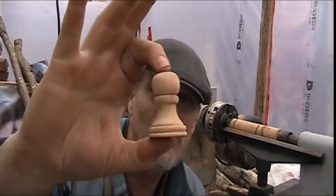I came up with a wee little one — that's about normal size, a little squat fat little guy, my own design. But it didn't work, not with 2x4s. The one I just showed you is not made with SPF 2x4 material; it's made with alder. The problem was the little collar and the beads on the bottom kept chipping out, no matter how careful I was or how sharp the tools were. A chip here and there can look rustic, but if it tears out bad it looks like a mistake.